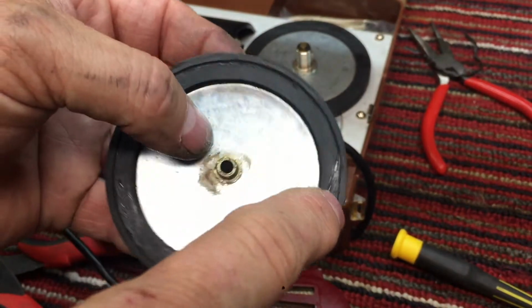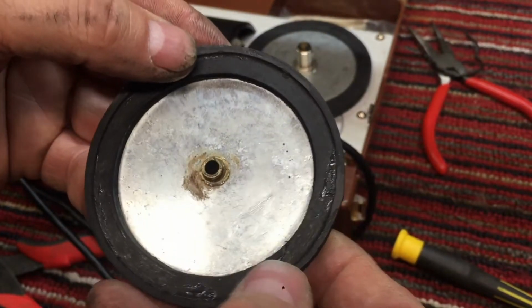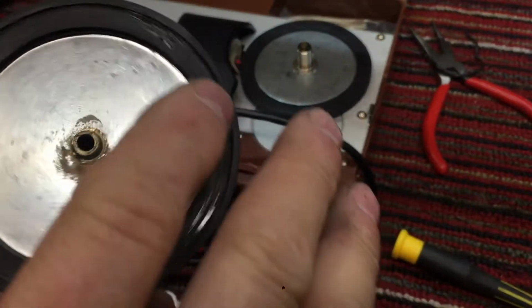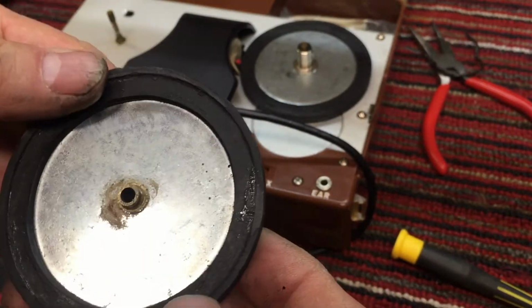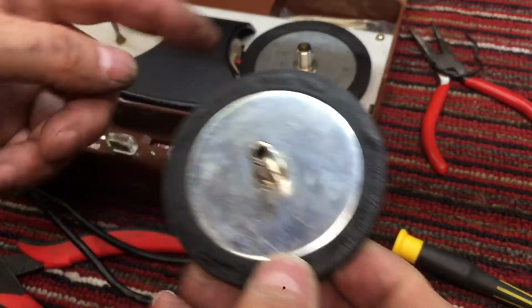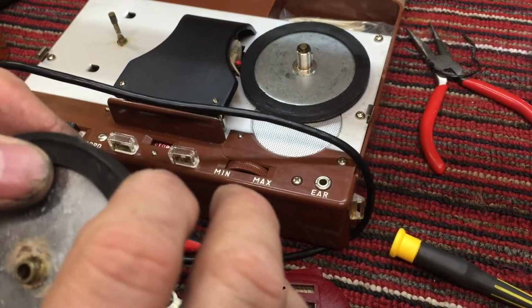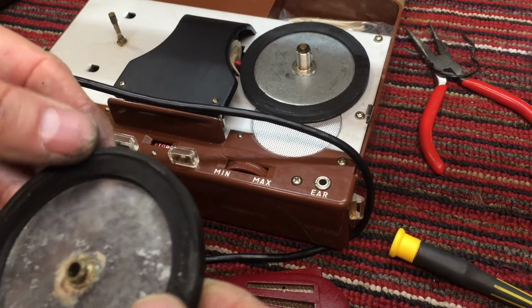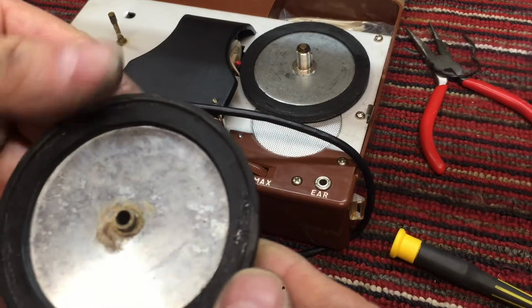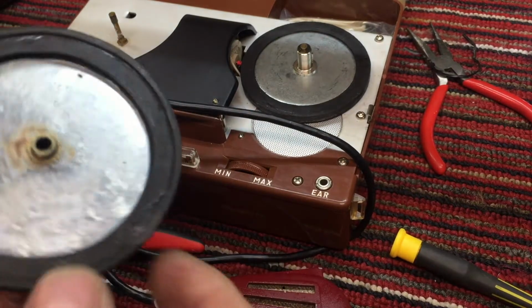Once again, I'm going to sand this ridge down to flat so that it'll be down even with this surface, and then we'll glue a tire or belt, whatever you want to call it, onto this surface. And if we do any better with the gluing, we might be able to swap these reels if we can get this a little more even once I glue it on there. So I'm going to try some different glue. I might have some CA downstairs that's super thin, because I think the CA would do a better job, and it wouldn't create these thick and thin glue spots.